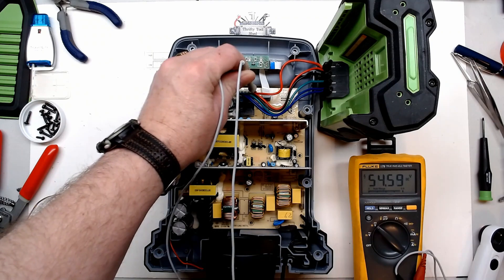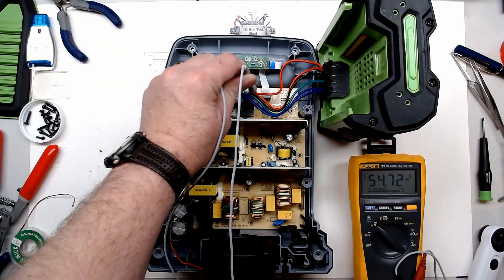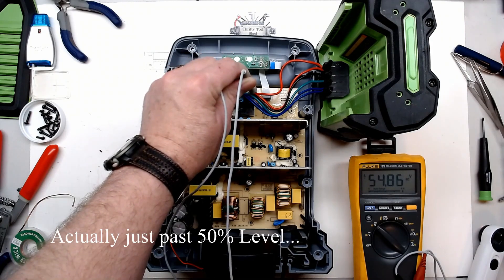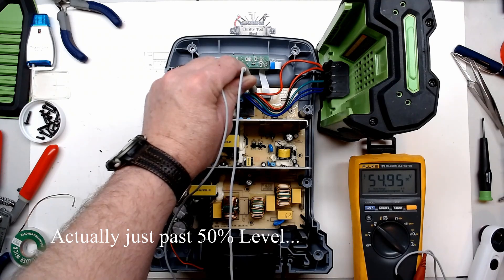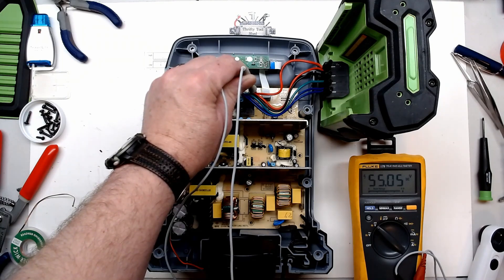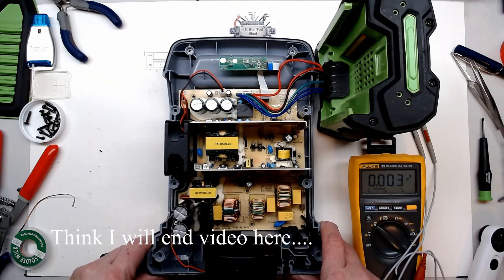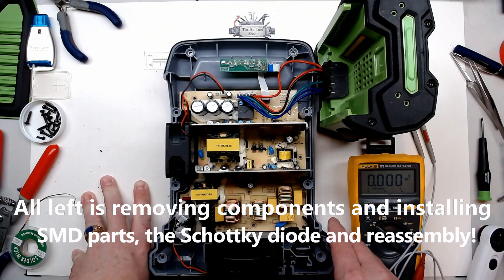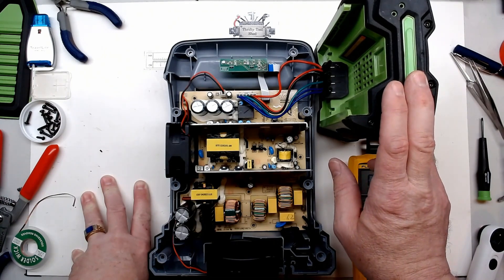I think we're actually charging now - showing 51 volts before, and there we go, bumping it up to the third level. That's awesome! So I just have a few components to buy and put on. I hope you enjoyed this troubleshooting video - that's what it took to get this EGO 30-minute charger back going. If you liked this video, please like, share, subscribe, and thanks for watching.